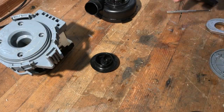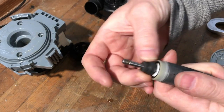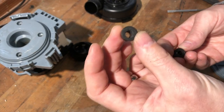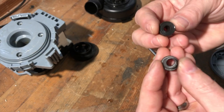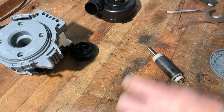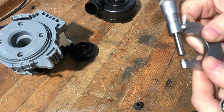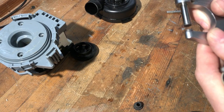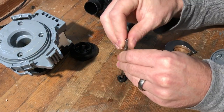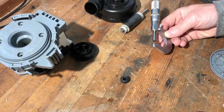With everything taken apart, you can see some pretty significant scoring around the lip, which is where it was rubbing. This is the one I removed from the bottom — I still kept it after over a year, just in case. The bottom one originally was much worse than the top one is now. However, this shaft is just under two hundred thousandths — about one ninety-seven. The inside of this bushing is about two hundred and fifteen thousandths. Close to twenty thousandths of play. Too big.